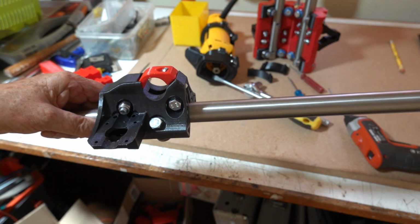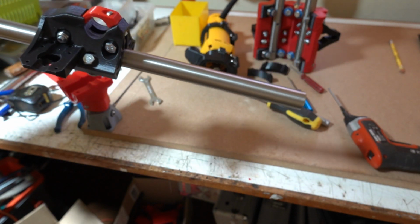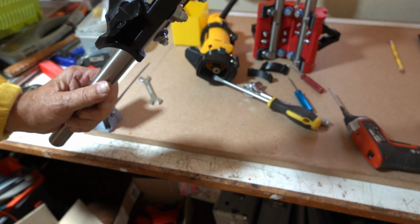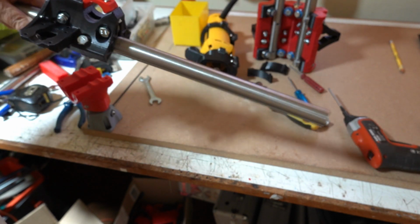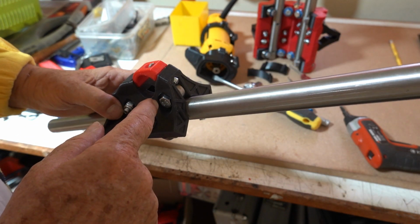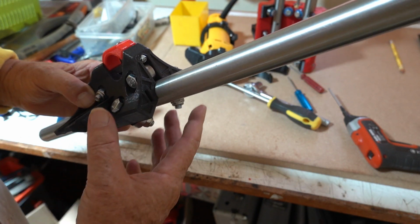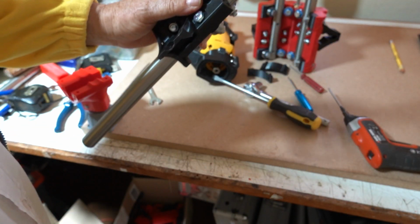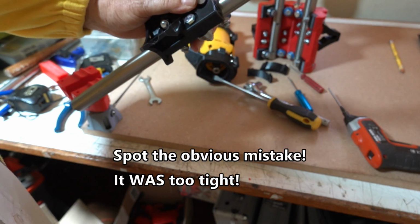So there's the truck. I've placed it on the rail to test it. They say that if you tip it at 45 degrees, it should start moving. So there you go, 45 degrees. Maybe this is a little bit too tight. The screws you've got to bother about are these ones that go through the main axis. If they're too tight, it'll pinch it together and it won't move at all. I think mine's just about right. Moves at 45 degrees.